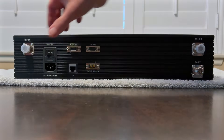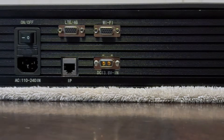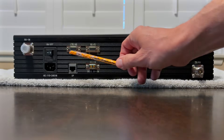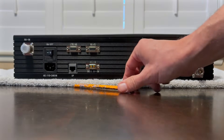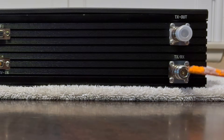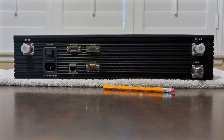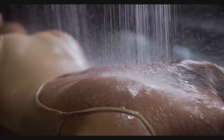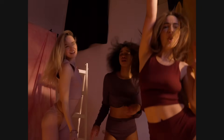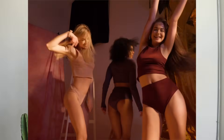On the back of the repeater, you'll find the on/off switch, the 110-volt electrical input, and a 13-volt DC input hole. You'll also find holes labeled LTE, 4G, Wi-Fi, and RJ45 — all of which do nothing. Because this repeater has a built-in duplexer, you simply connect your antenna to the hole labeled TX-RX. Should you choose to use a bigger external duplexer, you can change the connections inside and use the RX-in and TX-out holes instead. All antenna connectors are N-type, very different from standard SO-239 connectors, so beware you might need an adapter.